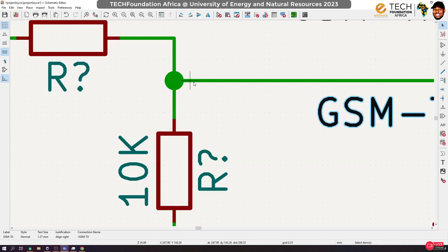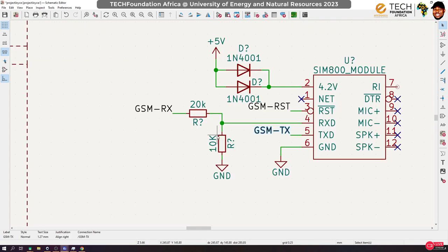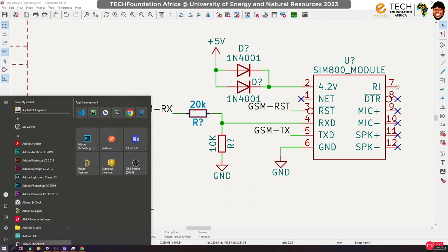Okay, so now how do we get about 3.3 volts here? We just have to select the right resistor values. Looking at this, this combination will give us 4 volts. So for V out here, 3.3, we can actually do the calculation. I just want to pick something very intuitive and simple. Now, technically, any voltage above 3 should work for that. Which combination can I use to get this quickly? Let's pull up the calculator.